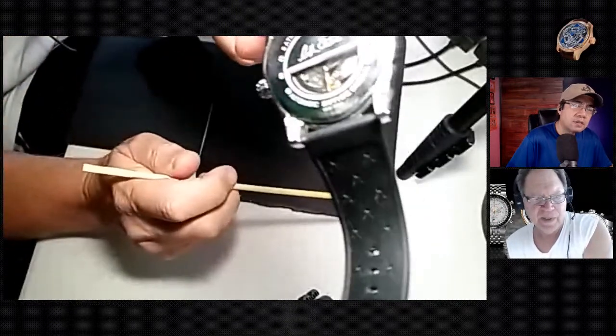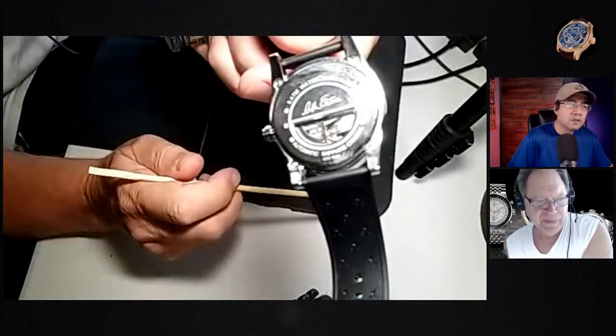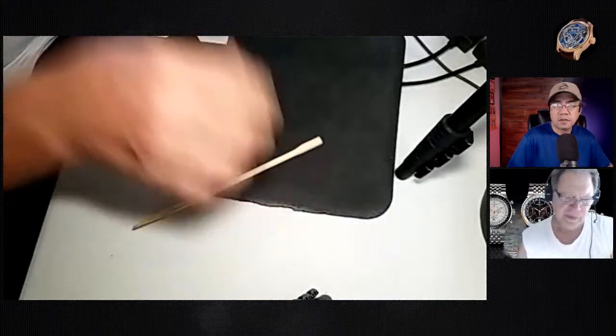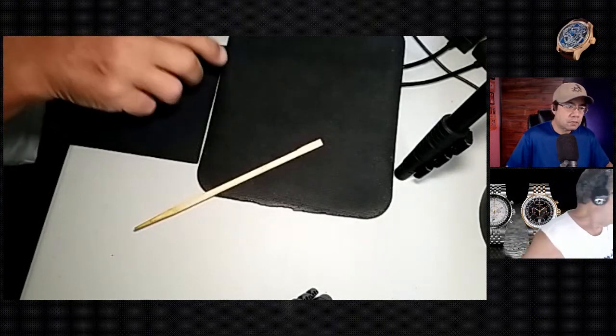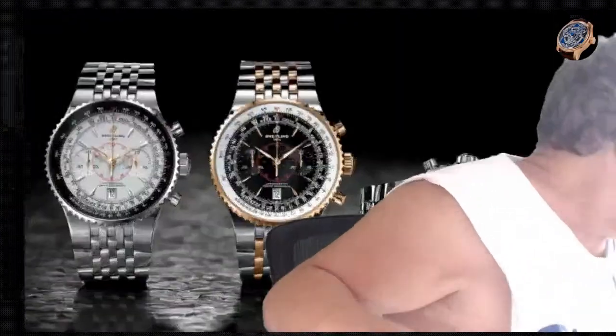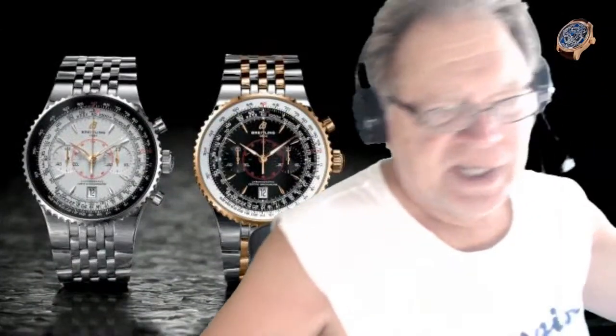And that's what I wanted to bring up a little bit. I wanted to talk about these components before we go on to the next watch. Since we hit this unique automatic watch, I did want to speak to the movements a little bit and give you a little bit of a picture about what's going on. The mainspring of the watch, first of all, is the central power source for the watch movement. It is a spiral strip of metal contained in a circular enclosure called the barrel.